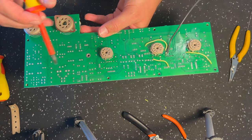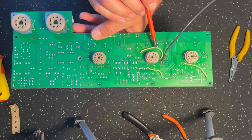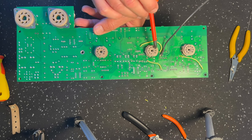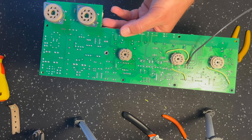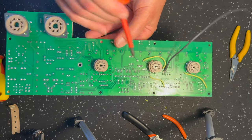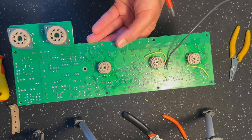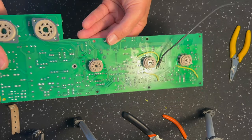Okay, this yellow wire here is connecting V2A into the equation. This is our cathode follower, and we're going to use this cathode follower arrangement on this triode to drive the tone stack, as I said, just like you would in a 2203, 2204 classic Marshall circuit. So this guy here is connecting the plate to the grid. Okay, plate to the grid straight there. Those are the only three connections you actually need if you're not doing the Jose clipping mod.